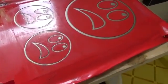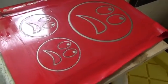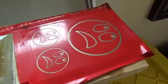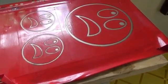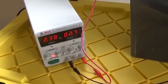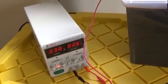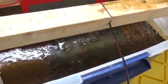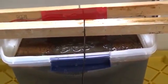Eventually the goal for this project is to see how deep I can go with this vinyl — to see if I can potentially make a brand for burning into wood or leather. You see a lot of videos online where you need a CNC machine or hand engraving pieces of metal to make brands that way, and I'm thinking maybe this could work. I also wanted to note that the meter is now reading 3 volts even though it's cranked up — I set it for 6 and it just kind of tapers off toward the end. I think it's because the water isn't quite as hot anymore and the solution is probably getting a little less intense. It is now 3:30 — I'll be back at 4:30.